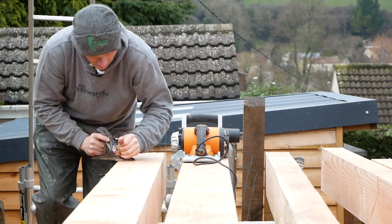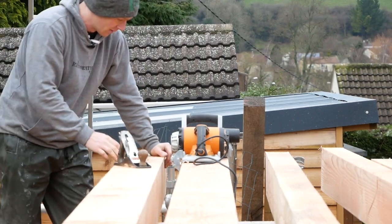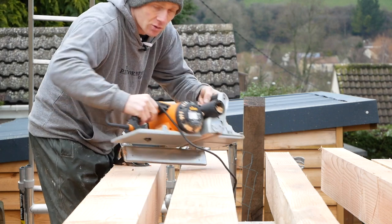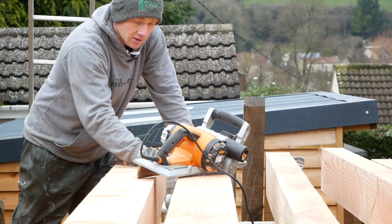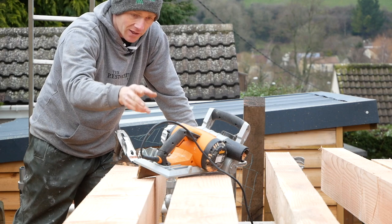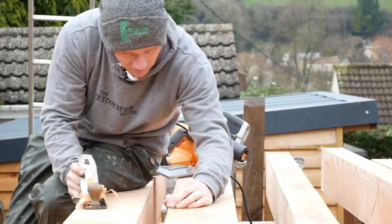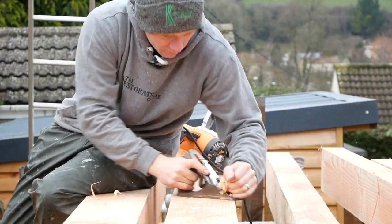Apologies for any wind noise — it's been a bit blustery today. The sawdust has migrated a little over the lawn but not too much. The thing I've had to use the hand plane for is this: the planer has a 180-millimeter cutting width. I ordered the beams as 175 or seven-inch, but because they're rough-sawn and oversized slightly, once I take a couple of millimeters off each side we're down closer to seven inch. But with the 180-millimeter triple blades there's a couple-millimeter ridge on the edge, so I just need to skim over that with a hand plane. It's completely optional — you can obviously frame with really rough timber or even logs — we're just making it pretty.